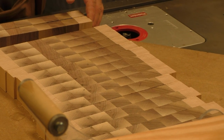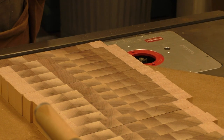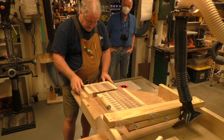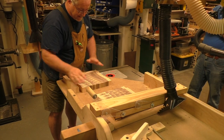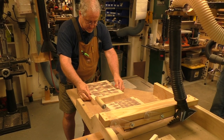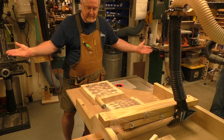My personal preference is to flip and turn them over to get different grain showing. If it were all dark walnut, I'd probably leave them as is, but because this is a mixture it's more appealing to make a camouflage-type pattern. I organize the walnut and can actually spell out letters in my cutting boards — LSU, UGA — but this one is going to be just a pattern. I've got hard maple on the outside, so I grab two strips that are nothing but hard maple, mix it up a bit, and flip every other one where it looks good.